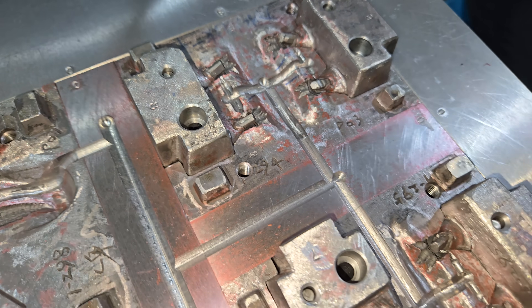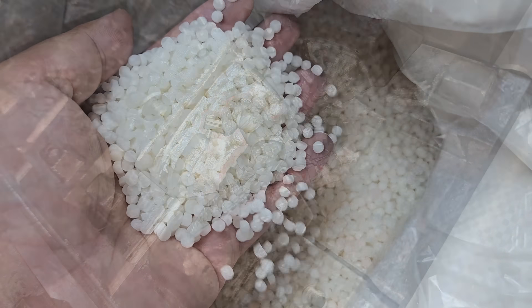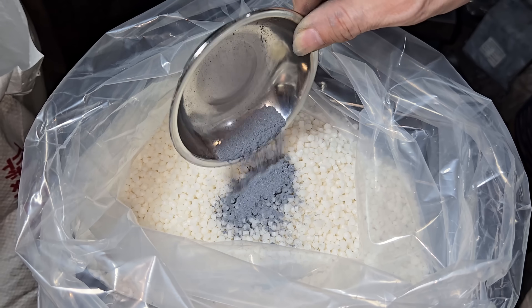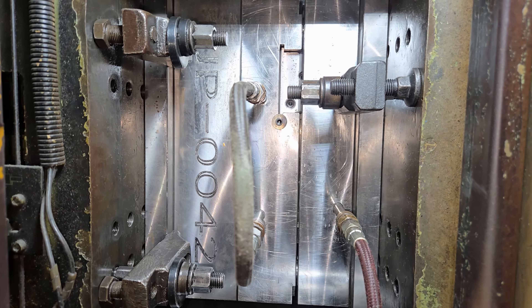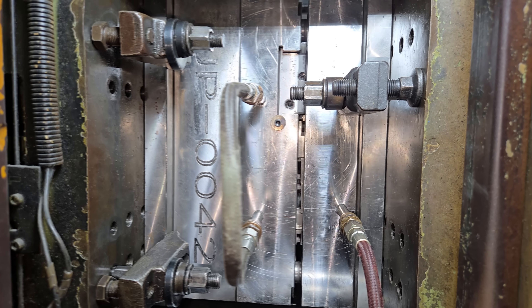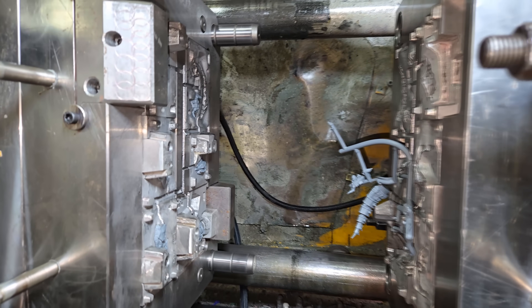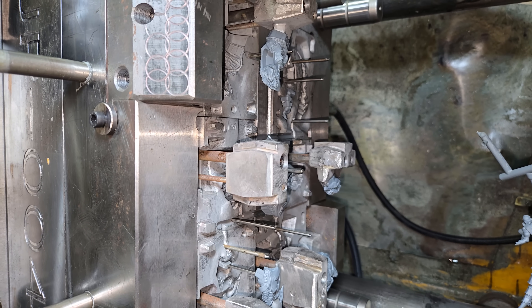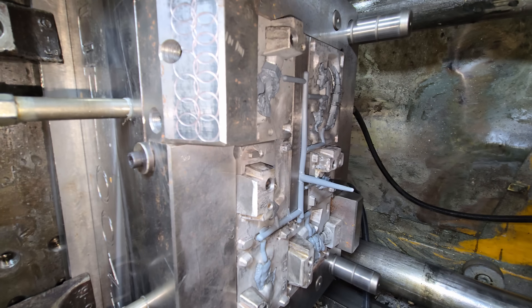The mold blocks are moving parts in the machine, so the way they attach is important. This whole assembly gets mounted on the injection molding instrument and now it's finally time to make some models. The PVC starts out as colorless pellets, and the gray pigment is measured out and mixed in. The polyvinyl chloride and pigment are added to the hopper, melted down, and injected into the molds. The two main halves of the mold come apart, then the side blocks pop out. It took a long time to get here, but now models can be made fast.